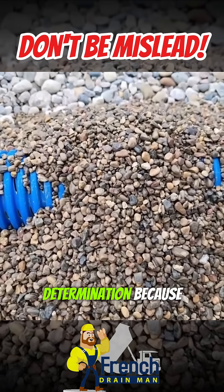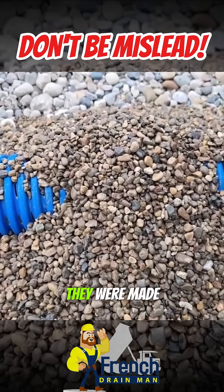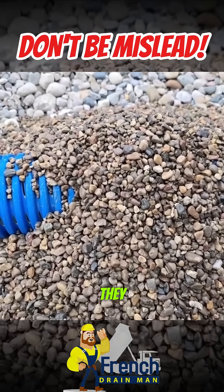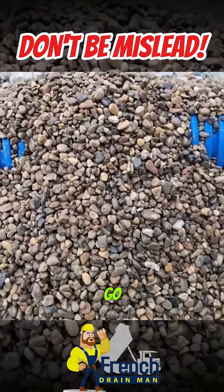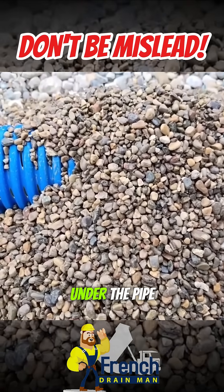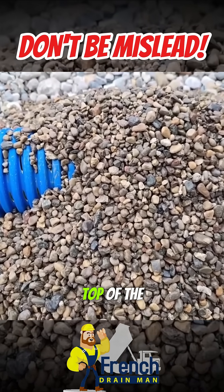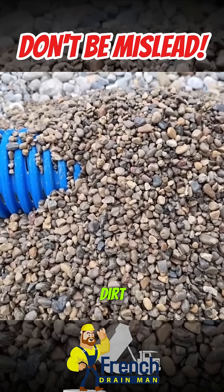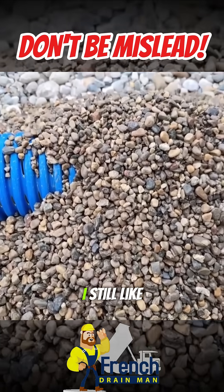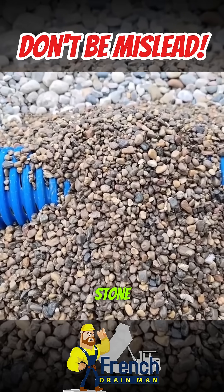You've made that determination because you've probably seen some videos that misled you — it's probably because they were made by people that didn't have the knowledge to install it correctly, so they ended up with poor results. So here you go: a lot of really small pebbles. You want at least four inches under the pipe. I really do prefer eight inches on top of the pipe because you're going to throw dirt right on top of the P-stone and you're not going to put any soil separator. And I still like a wide trench — I always like a wide trench.